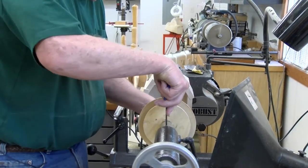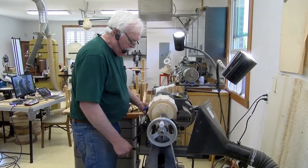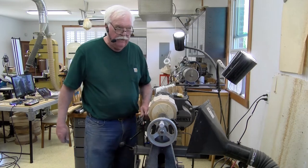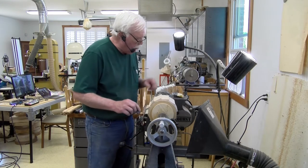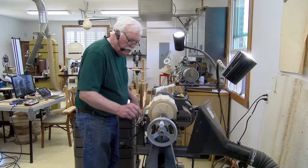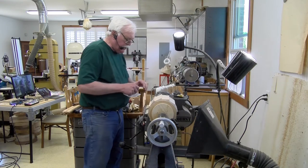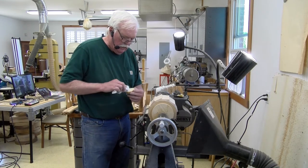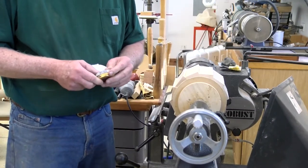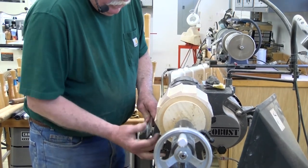Make sure this is tight — there we go, it's going right in and seating in there. I'll put a little pressure on there and put my tool rest up. One of the things I like to do, especially if I'm using my gouge, is to take a piece of steel wool and just clean that off and get it smooth, because any bump or surface imperfection on this rod is going to transfer to your workpiece. I might also take some Kiwi wax and just rub it across the top — that gets a nice smooth, resistance-free surface.